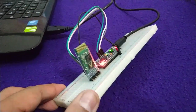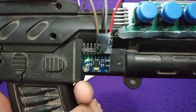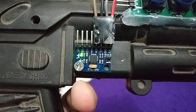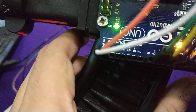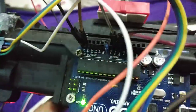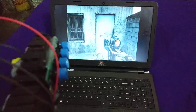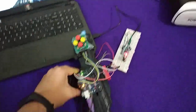The master device has a gyroscope and accelerometer, but we are only using the gyro. The gyroscope is connected to the Uno's analog pins — here's analog pin A4 and A5 — and the gyroscope is working like mouse movement.